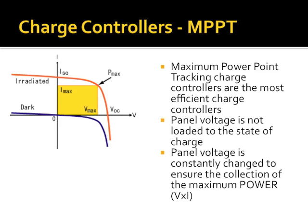So the net effect of this is, I've read you can get like 15 to 30% more energy out of a given set of panels using a maximum power point charge controller than you can using just a traditional standard pulse width modulation. I have one of each. I haven't directly empirically tested this, but the science behind this makes absolute sense, because there is a microprocessor in here that literally maybe 50, 60 times a second is recalculating what is the best possible position, which is good, because if you've ever had to maintain a solar array and keep it aimed at the sun, you find out the sun moves a lot faster than you ever give it credit for.